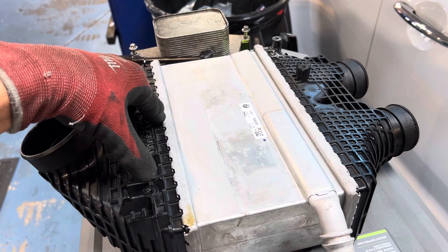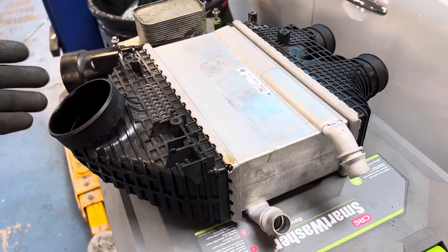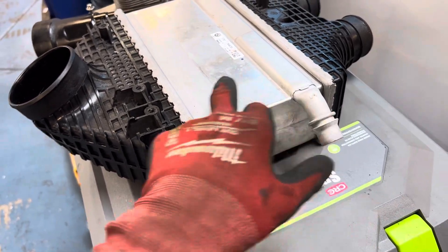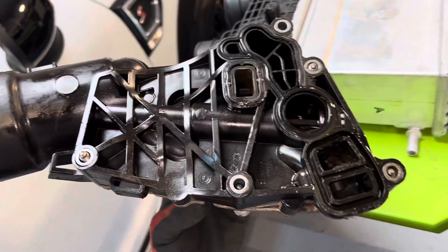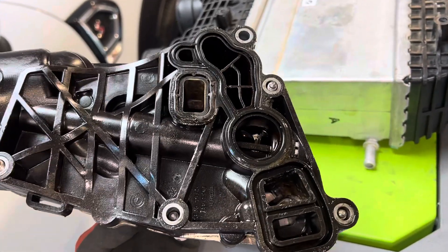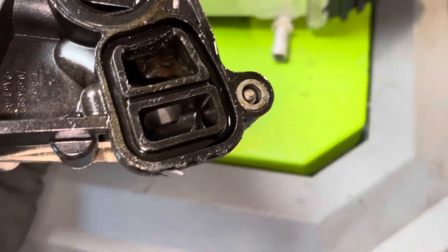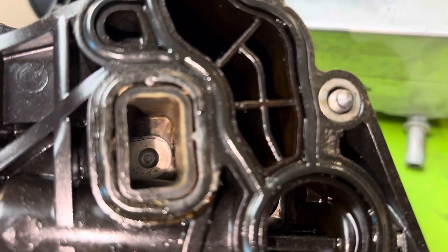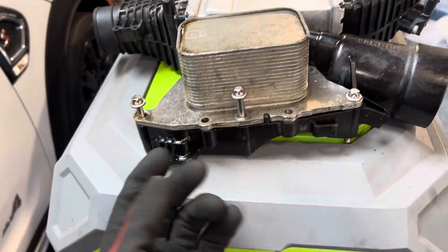Let's get to this heat exchanger — but it's not for air conditioning. This is for your turbocharger, and this is your coolant for cooling it off from the turbocharger. This is for oil, and this is for the oil filter, and this allows oil and coolant to cool off the oil, because oil can be three or four hundred degrees. You can see the coolant passages with crusty coolant in them, and then shiny passages — that's all oil — and then a little crusty inside there, that's coolant. They interchange inside this plate heat exchanger.